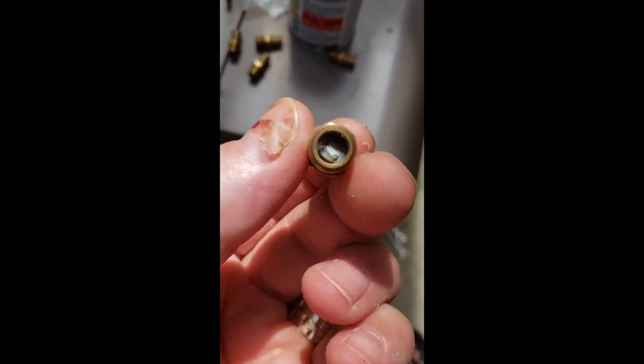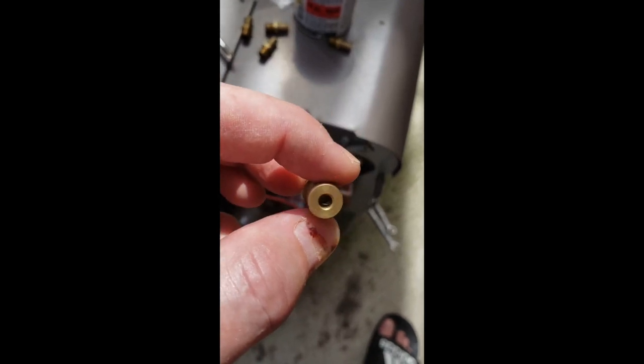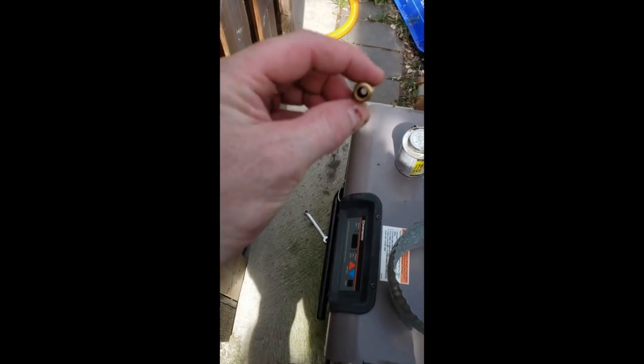So what I'm going to do is take a paper clip or a metal wire, put it in there, and clean the gunk out. I've taken a wire — actually an old telephone wire I had sitting in the basement. It's a nice long one. I'm sticking it through the hole, getting the spider webs out of the nozzle. I've now done this for all five of them and it's nice and clean.